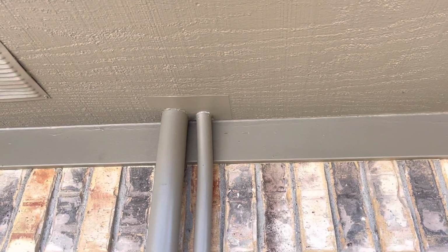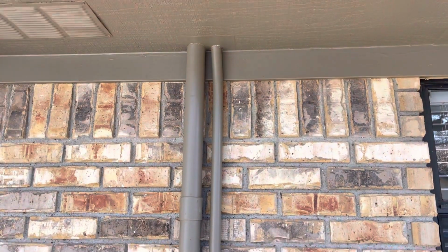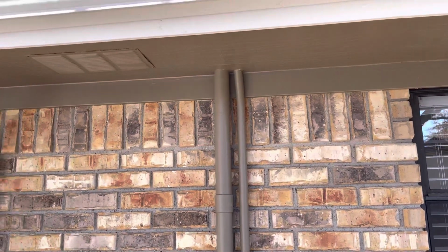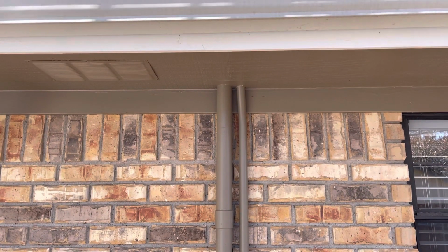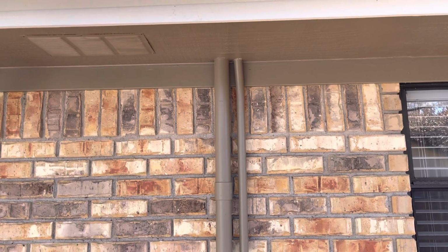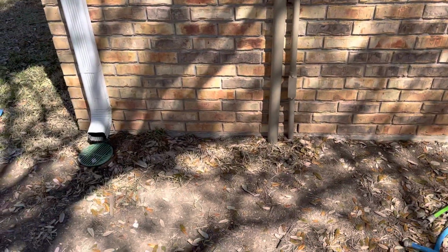There's a little insulating bushing, that way if I ever wanted to run anything more, I just have to go up to the attic there and run more cable and internet if I want to. There's also one, I think it's called electrician's cord, pull cord. I don't know what it's called, but electrician's line. So I pulled one cable, one internet, Cat 6, I think it's 6A. Anyway, Cat 6, coax cable, RG6, and then I pulled that electrician line. So I got two wires and one rope, basically, in case anybody wants to pull anything more through here. It's all about the future.